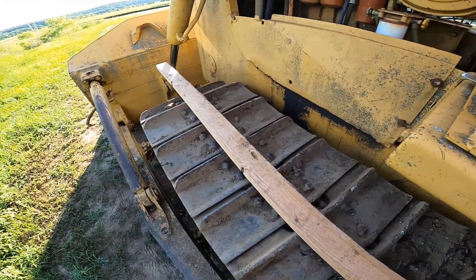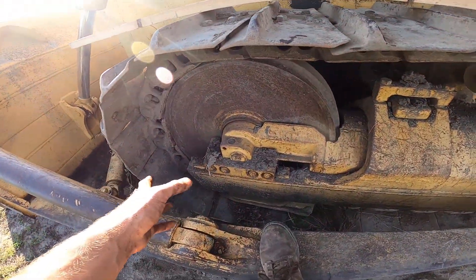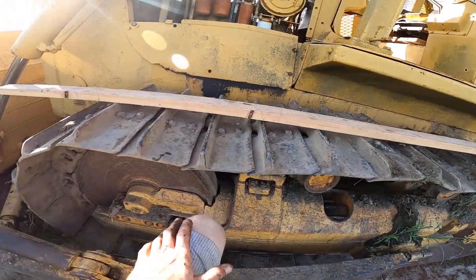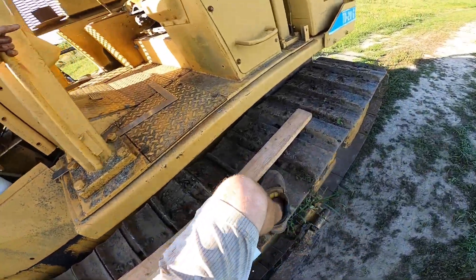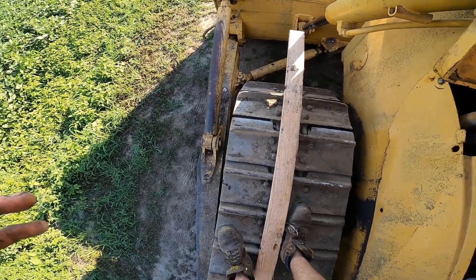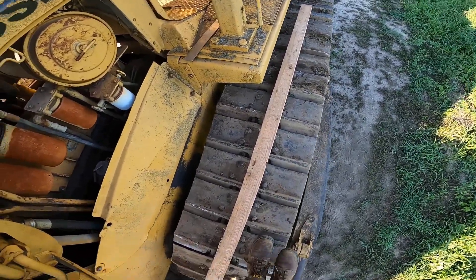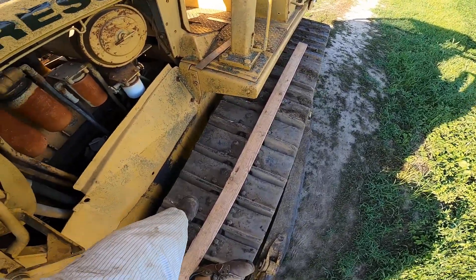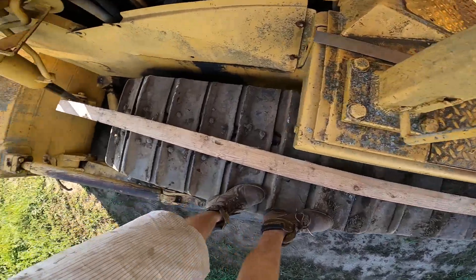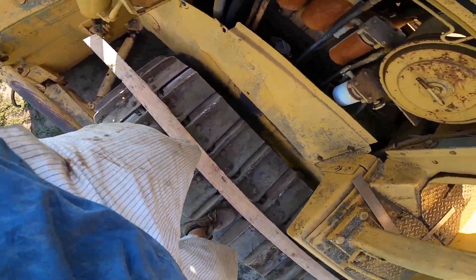I hope this video helped you. They're all basically the same — they all have a piston, you shoot grease in there, and it moves the front idler wheel, which tightens up the tracks. Pretty simple but a really important thing to check, because it makes your machine a lot less efficient if the tracks aren't tensioned properly. It's going to bounce you around and make the ride rougher if they're loose. If they're too tight, that's going to kill your power and wear out all the bearings, idler wheels, and a whole bunch of really expensive stuff. So spend the time to check and tension your tracks.